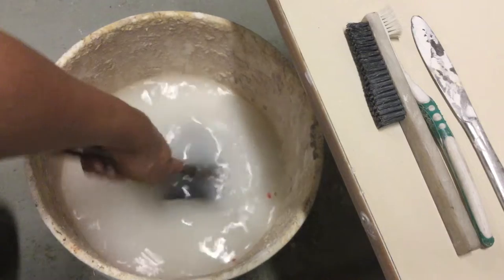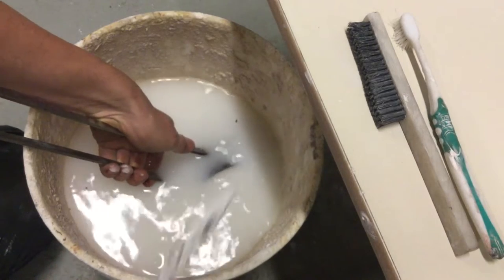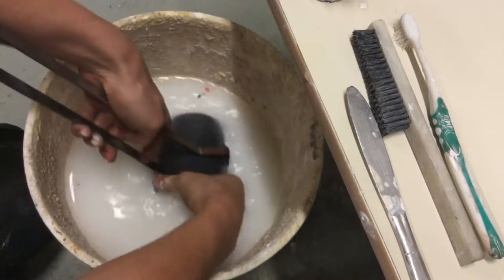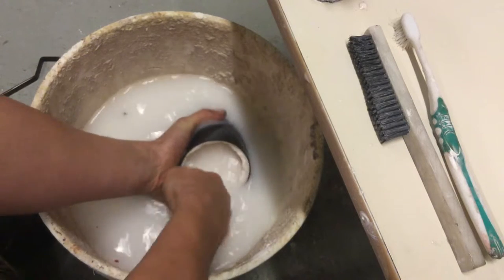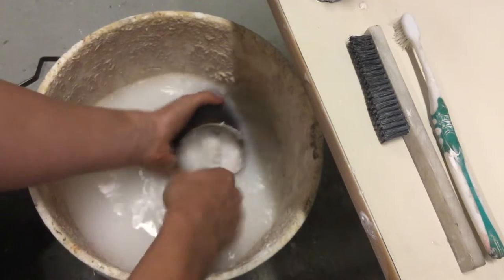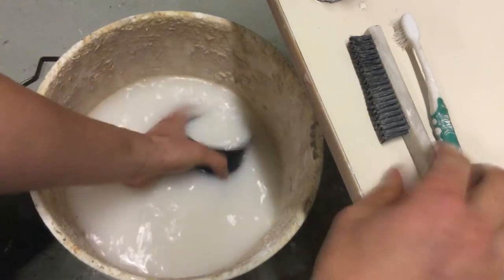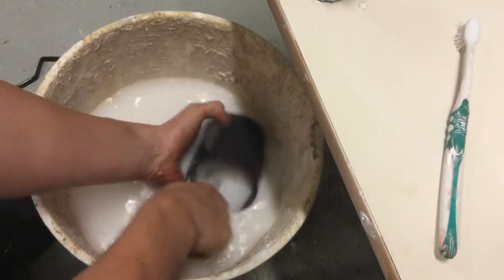So once the boiling stops, you'll be able to go in with your butter knife to pry it loose. We'll just reach in — and there is our cast part. We're going to set that aside, grab our flask, and use the butter knife to scrape out any remaining plaster. Turn it around, scrape out the other side, rinse off your knife, wipe it on the edge of the bucket, and then use the nylon brush to scrub off any remaining debris from the interior before you grab your part.